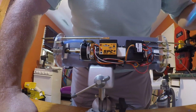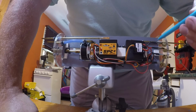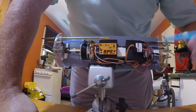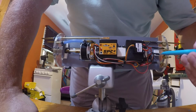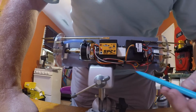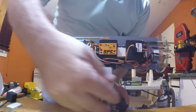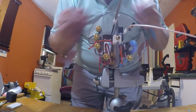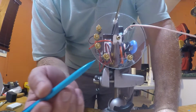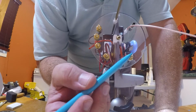Okay, and here are the electrical connections. What we're looking at is the two connections that will go to the ballast pump. This is the ground return connection. That's important, the ground return connection from the solenoid that operates a ballast blow. And here is plus 12 volt in, which feeds the plus 12 volt rail, powers the model and the ESC. Looking forward, again, these connections: ballast pump, gas blow, positive, plus 12 in. This is the ground, or minus 12 volt out.